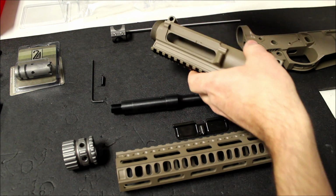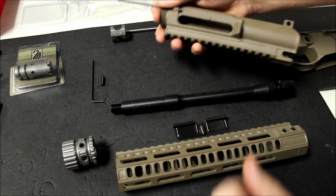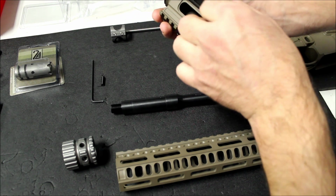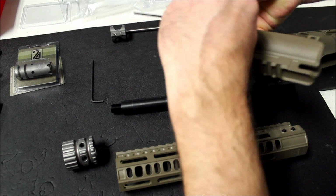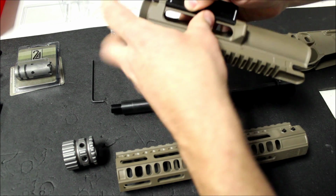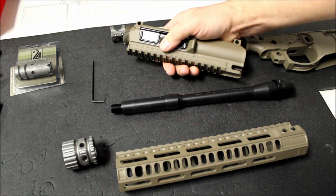With the port door, I simply start the rod. You remove the E-clip like I did earlier there. Take your port door, take your spring, lay it in place, rotate that spring 180, and then I just like to push down on something to get that started. Now that it's started, I can seat it and check that it closes.